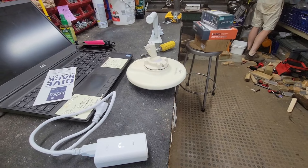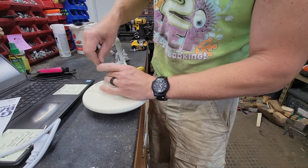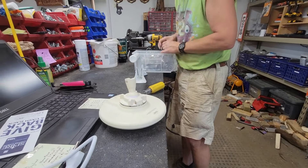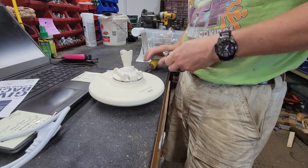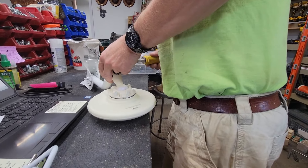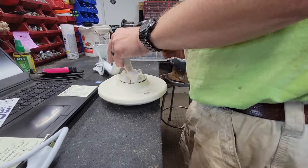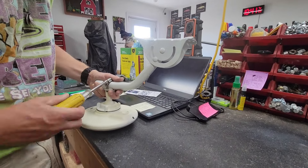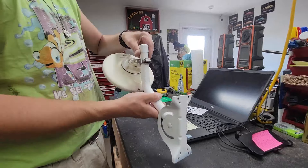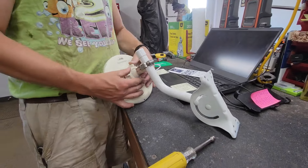For the house side, I had to buy an antenna mount to attach it to my house. I got this antenna mount from Menards — I think about $20, an RCA antenna mount for homes. It came black; I painted it white because my house is white. A simple clamp attaches it, then one nano beam goes on the house and a different nano beam goes on the pole. When you first turn them on, they put out a WiFi signal for about 10 minutes. You pick it up on your phone, put in the same passwords on each, get the two to shoot at each other, and it's kind of plug and play — I was impressed how fast.